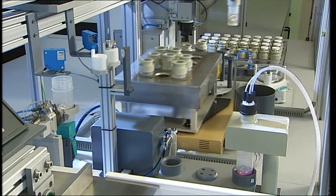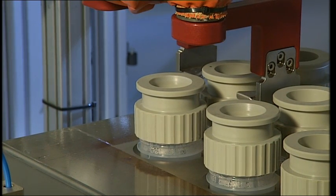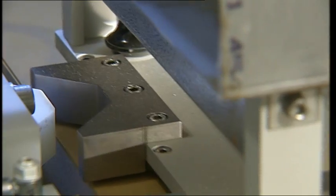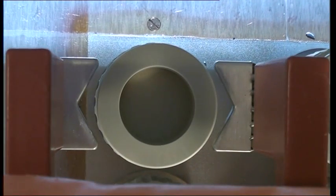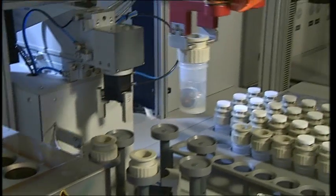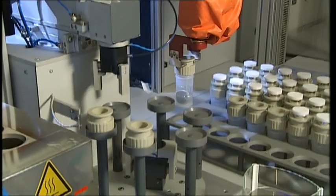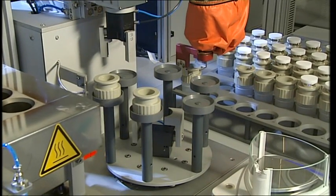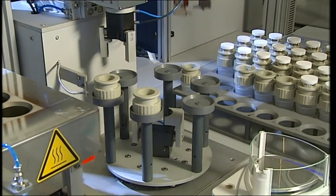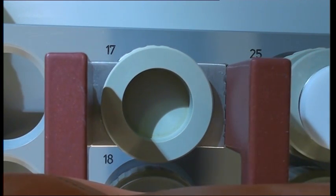In order to accelerate the dissolution process, the beaker is placed in a heating shaker. The steady motion and simultaneous heating in the hydrochloric acid medium brings about complete dissolution of the melt. After a predetermined time has passed, the beaker is placed back into the rack, where the beaker and its contents can cool down to room temperature before being re-weighed on the analytical balance.